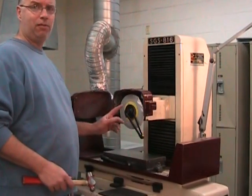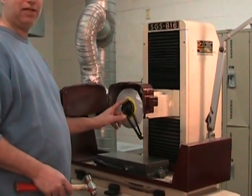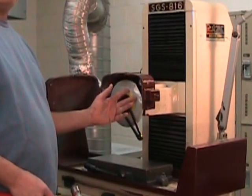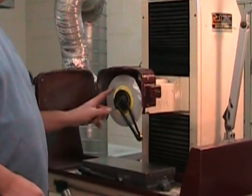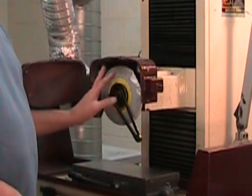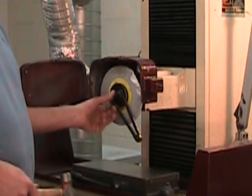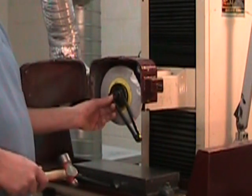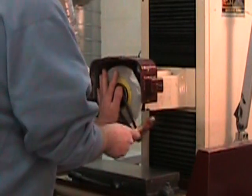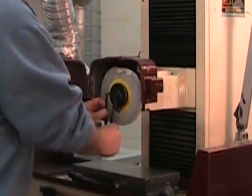It's evident that I normally wouldn't have to use this much force to disassemble this threaded flange, but remember this grinding wheel was violently stopped. What you have to remember is that since this threaded flange has a left-handed thread, it's normal that once the grinding wheel stops violently, the threaded flange gets over-tightened. Okay, finally.